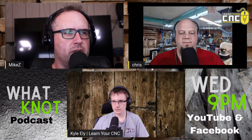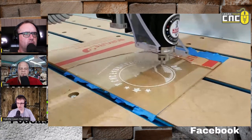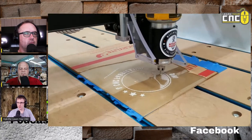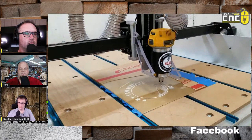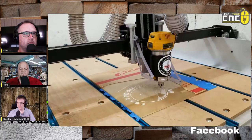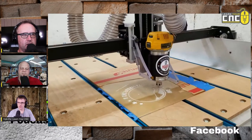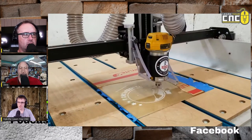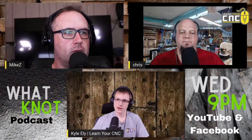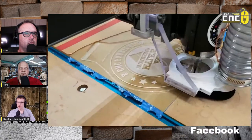I think I've got two more ornament videos here. It's the same technique — engrave on the backside with the diamond drag, then cut out with the O-flute bit. And this may seem obvious, but you have to do all this in reverse. If you're engraving on the backside, make sure you mirror it before you engrave. I've done it before where I forgot — and you only have to do that once to remember.